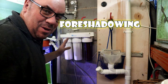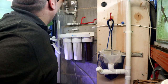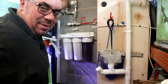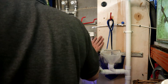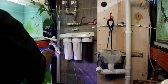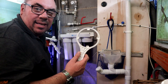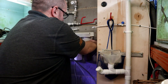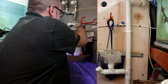Changing these cartridges is fairly straightforward and doesn't take a long time, but I've yet to do it without making a mess. Turn all the water off — in my system that's already off, then turn off the cold water so no more water comes through. Let a little bit of water bleed out of the system so there's no back pressure. Then they come with a wrench — you basically slide on the wrench, lefty loosey, and get that undone.